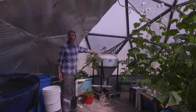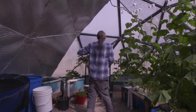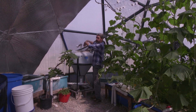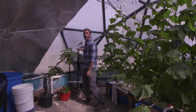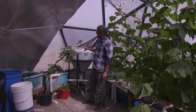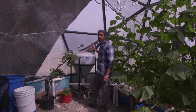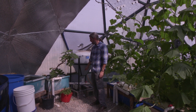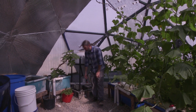This is just a cone-bottom tank where I put every bit of my sludge daily. I open it up, put my sludge in, and now I want to add aeration — enough oxygen to let the microbes break down the solid waste. I also need circulation so the solids don't settle to the bottom. Because it's a cone-bottom tank, I've plumbed this with an airlift pump.